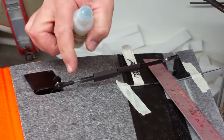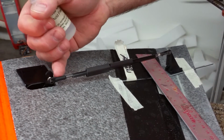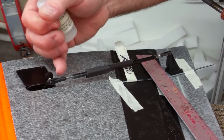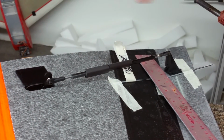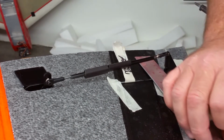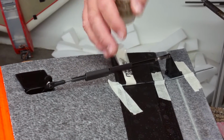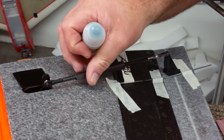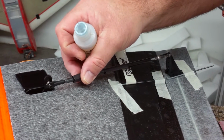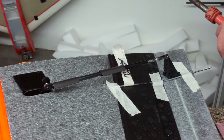This allows you to have about half the threads available. So when you get this, you wanna screw your ball joint on about 5 or 6 revolutions so you can get a little bit of thread in here so you have some adjustability. Once you get it into place, you have the capability of adjusting it in the field later. So do not lock these in, do not lock the shrink in until after you're in the field and you have all your field testing done and everything is basically zeroed and centered where you want it.